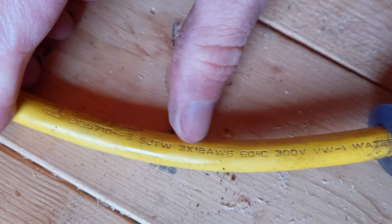This particular welder runs off of a 110-volt input with 20 amps. I have it on a plug which has a GFI circuit on it, wired into a 20-amp breaker in the house. They say you're not supposed to use an extension cord, but I need to - the cord I'm using is 12 AWG, which is the wire rated for 20 amp. Normal extension cord is only rated for 15 amp. It's raining outside right now, so we're definitely not welding outside. We're going to open the garage doors, get our protective gear on, get our masks on and all that.